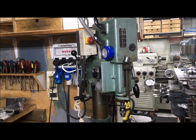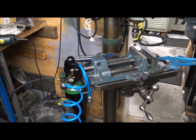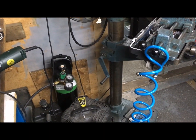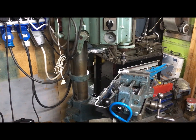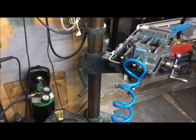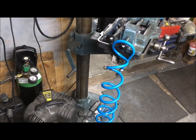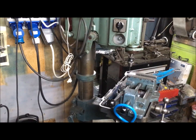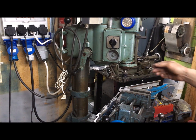This is a very nice piece of equipment, I think. The Arboga comes in a variety of variants — mine is with an XY table. You can drill very long slender pieces by moving the head to its uppermost position, then winding the table down all the way to the floor. Or you can move the table up and the head down. Plus you have a quite long quill here.